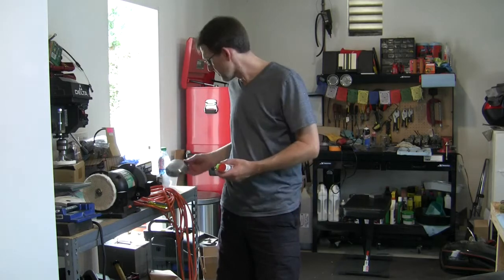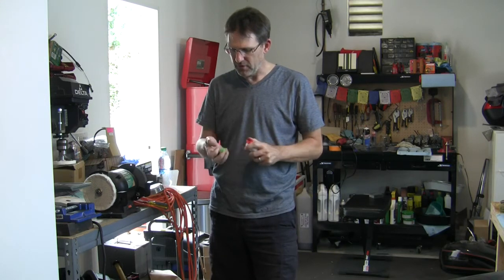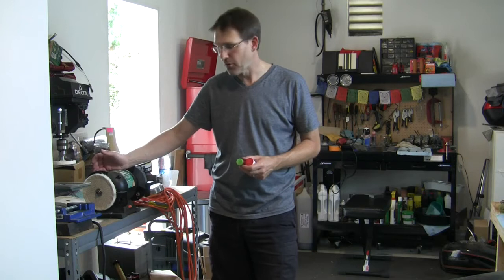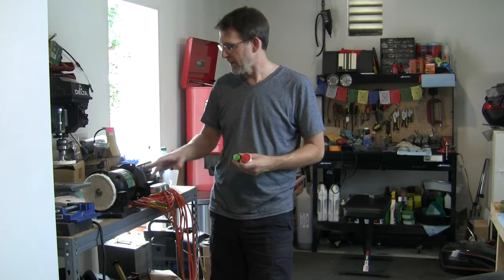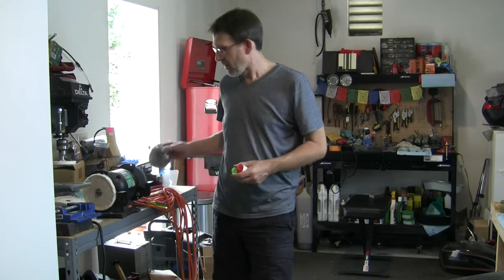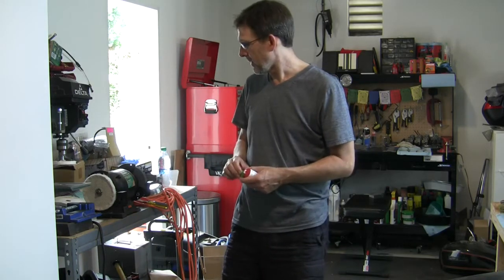So I've got a pretty nice sheen going on this thing. The next step is to polish, essentially. This is Tripoli compound, but it got a little old and dried up. I have a small amount of the same brown polishing compound — this has a little bit heavier cut to it, so you start with this. I've put this buffing wheel onto my bench grinder. I'm going to buff this part up — it should start to shine pretty good. Then I'll follow up with a metal polishing compound, using a separate smaller buffing wheel on my drill press. Two-step process: deeper cut first, and then the finest polishing.